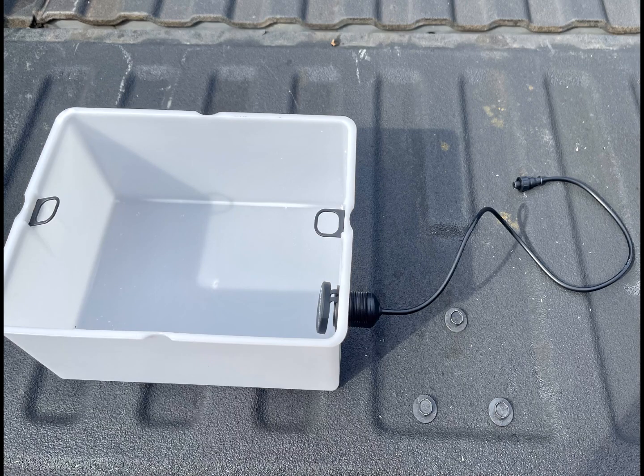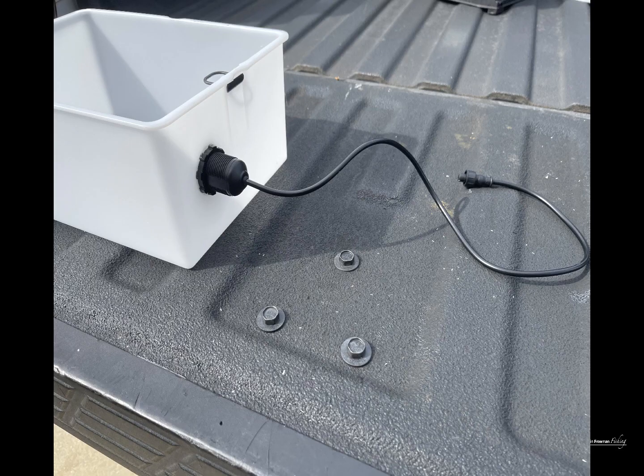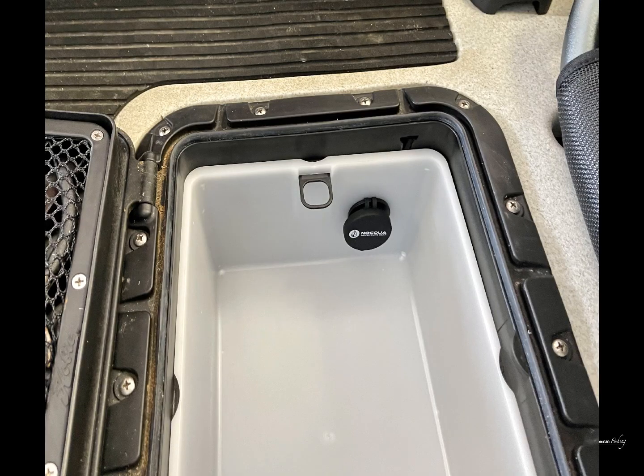For installation, I have a Hobie Pro Angler Kayak and I decided to install the dual USB adapter into the Hobie bucket in the center hatch. I had to make a cut — a one and one-eighth inch diameter hole — into the side of the bucket. Once I did that, I inserted the USB adapter through, applied silicone all the way around, tightened up the locking nut on the back, locked it in place, and ran the wires back to the front of my batteries. Overall it's a pretty clean install, and it'll be really nice to charge my phone, GoPro, or any other USB device down in my Hobie bucket.